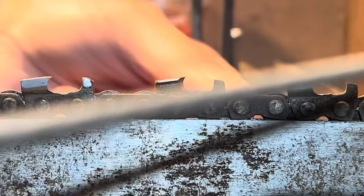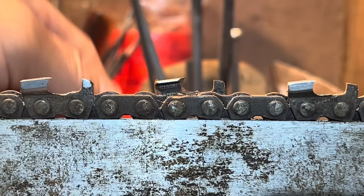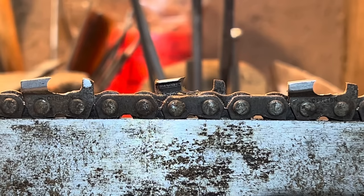Remember, friends, I'm just trying to get the camera so you guys see this happen. I'm pushing down until I get that gullet gone. Look at the original - look at that, that just changed already. That's a cutting tooth, but guess what? It's actually not - because there's the corner smashed off it, friends. So now that you're down under here and you're where you need to be, this is where you need to change the grip on your filing and settle down. Let the file do some gliding - you've already dug it out.